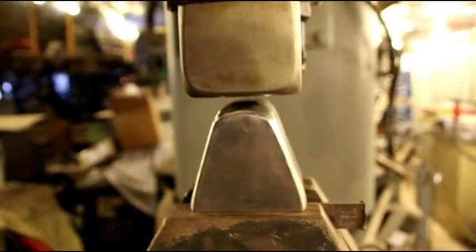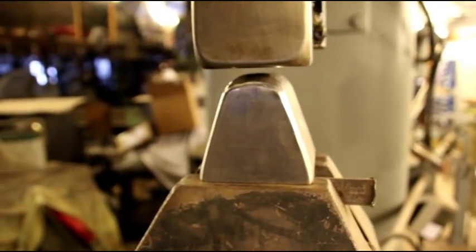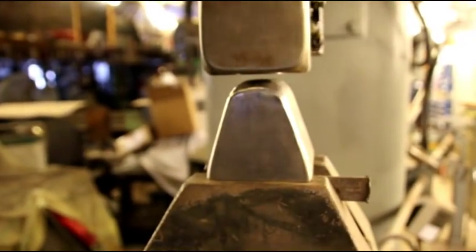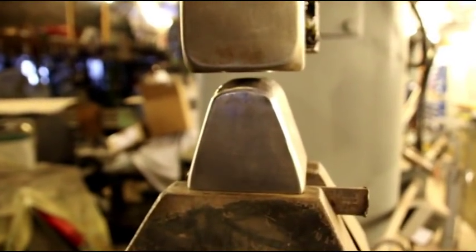Like I say, if you use a jaw type stretcher, you'd tear the material immediately. You've really got to stretch it out by compressing it, and that's what I'm doing here. So I'll continue stretching it, tipping it up, stretching it, tipping it up, and pretty soon we'll be at 90 degrees, and I'll show you what that looks like in just a little bit.